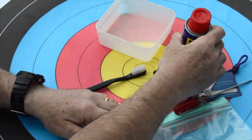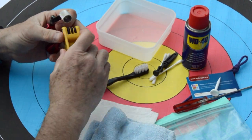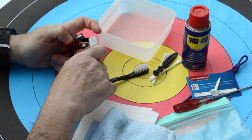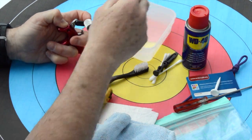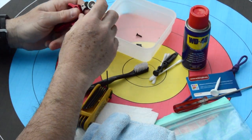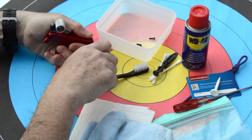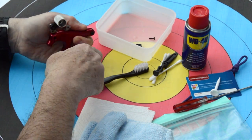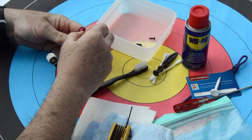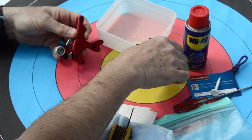So first things first, let's get hold of the release aid. I happen to know that behind that block is a small spring which sets the release tension. So I'm going to remove that one first — keeping my thumb over the top of it because I learnt my lesson some time ago. If you don't, the spring launches this block halfway across the kitchen. So small parts go in the pot. Next I'm going to loosen the other two Allen head screws that are holding things in place. I'm not going to remove them completely because inside there's a bunch of small parts including some small springs which have a tendency to lose themselves absolutely everywhere, and you'll spend the rest of your day trying to find them.